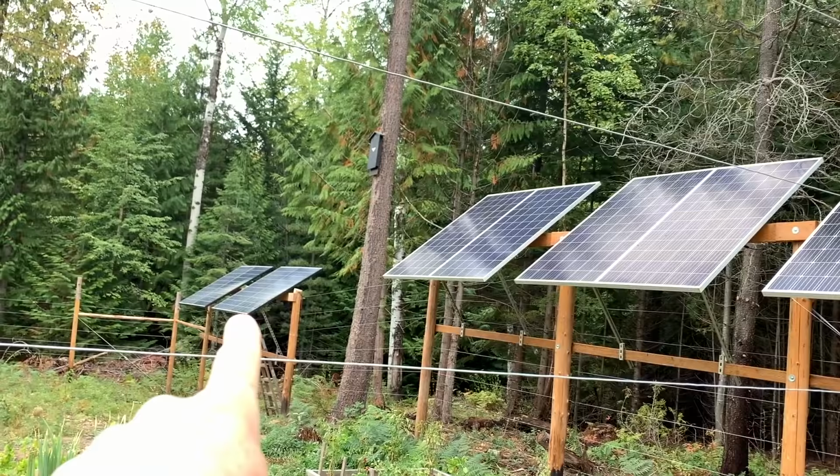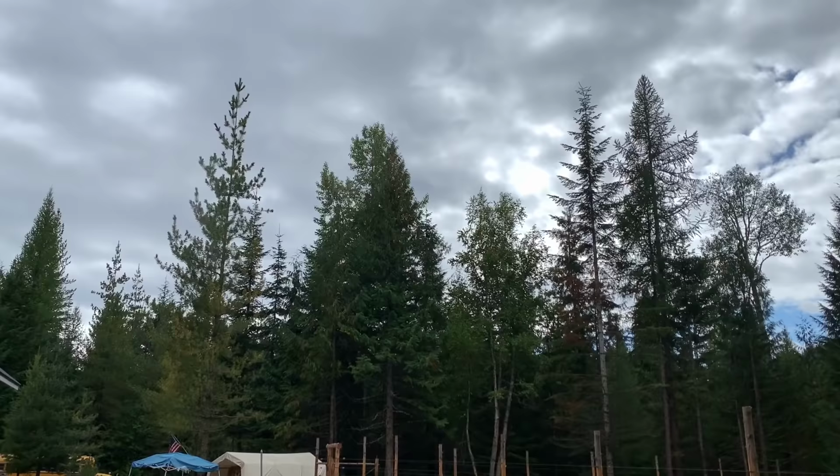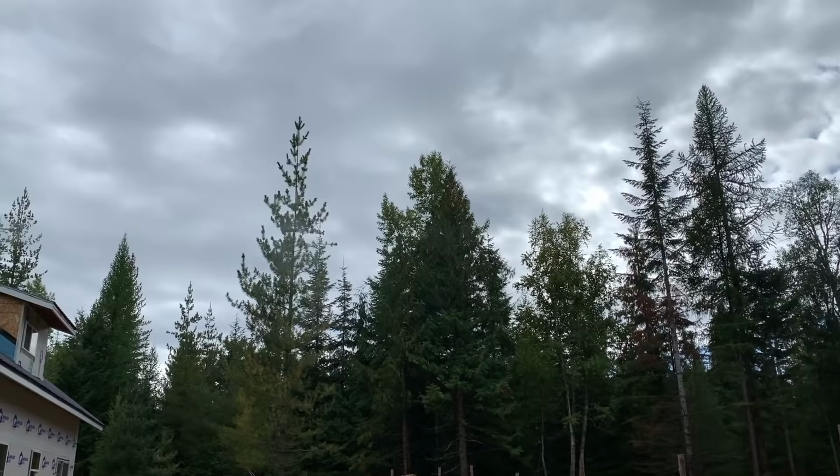You saw these panels earlier, but we've also added these four panels down here as well. So there's 1, 2, 3, 4 panels. And if you're wondering how we built our racking system or our solar panel mounting system out of Unistrut like this, well, I made an entire video on how to build those things, and that link will be down in the description of the video as well. All of those panels add up to 3,200 watts, right, on a perfectly sunny day. Which, as you can see, today is not a perfectly sunny day. But that's okay, our solar system is doing okay.